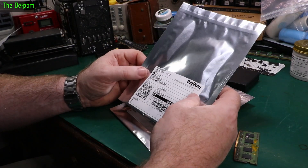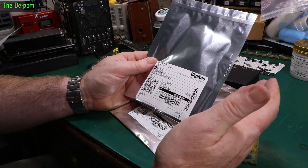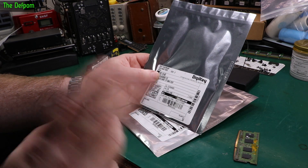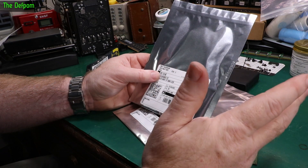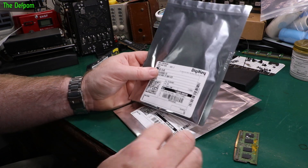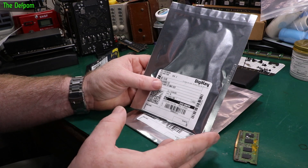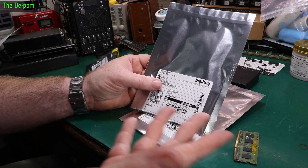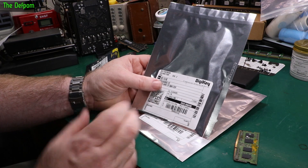What I'm actually working on is the Synology NAS. Its internal flash has basically failed and corrupted and I cannot rewrite it. I actually have two of these NASes - one is mine, one belongs to my dad. He was using it and it died. I hooked into the serial communication and read the output to see it was failing a checksum. I pulled my NAS apart, read the flash from it, and compared it to his - we've got different versions of the software on the flash.